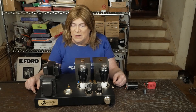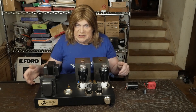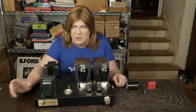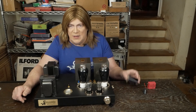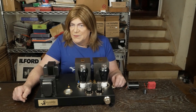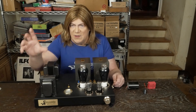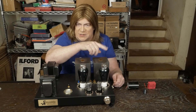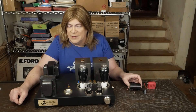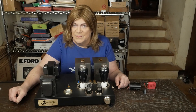That's really got me rethinking the importance of tuning power supply components to adjust the sound signature of the amplifier and the impact they have. One thing I want to do next is pull out the Sølens and put in a Nichicon electrolytic cap and see what that sounds like — good, bad, or the same — because I've built several smaller amps without a film cap on the first cap using just electrolytics. I'm not sure why I put a film cap in this amp. My 6SQ7 amp has the same Sølens film cap on the front end and it sounds fantastic.